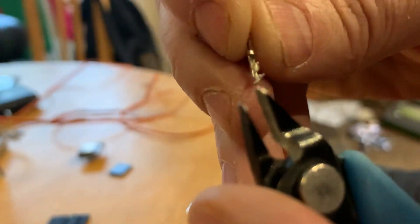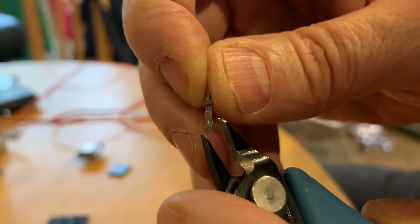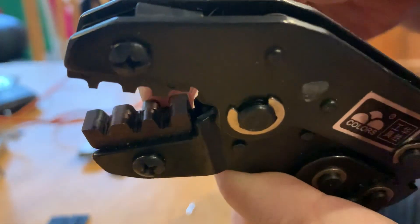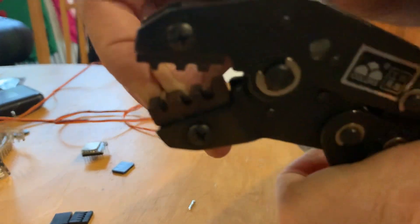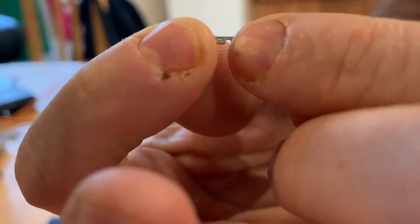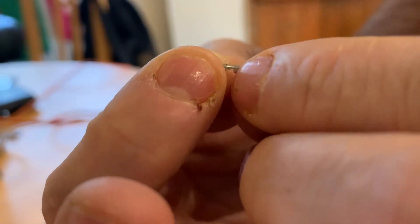These things are really tiny. You've got two things that stick out on here which hold the cable, and two more narrower pins that hold the wire. The cable ones go to the thicker end of the crimper. I'm positioning them so that the longer pin and the slightly narrower pin are in the crimper — what I don't want to do is crimp anything past that second pin.